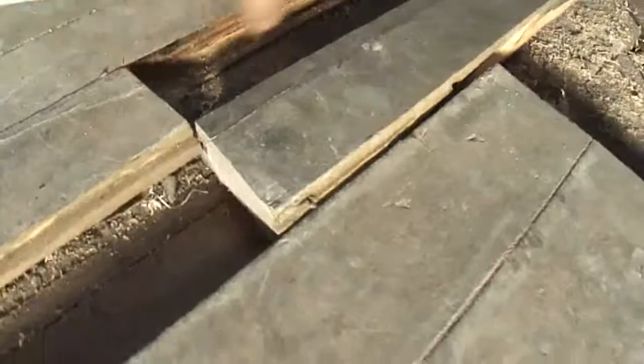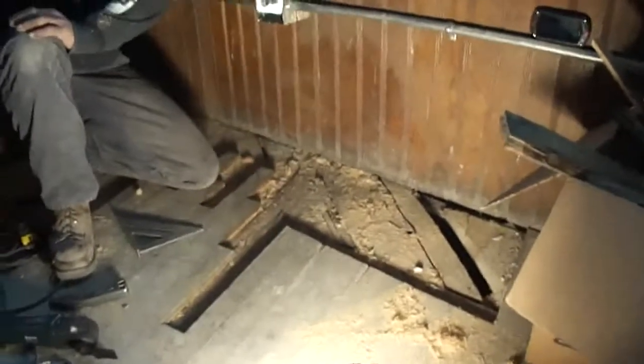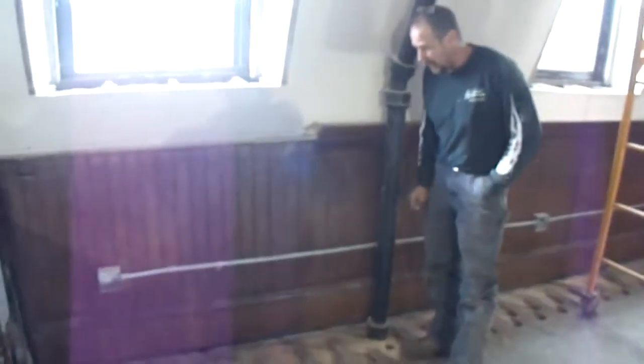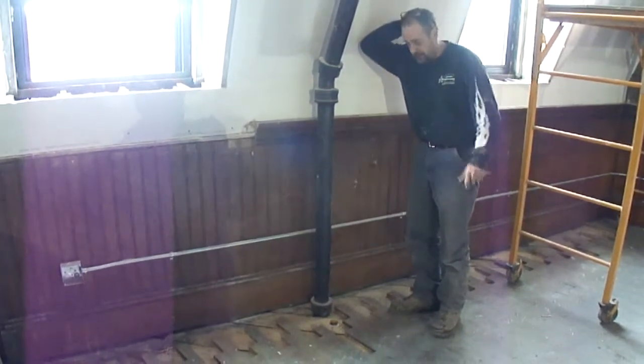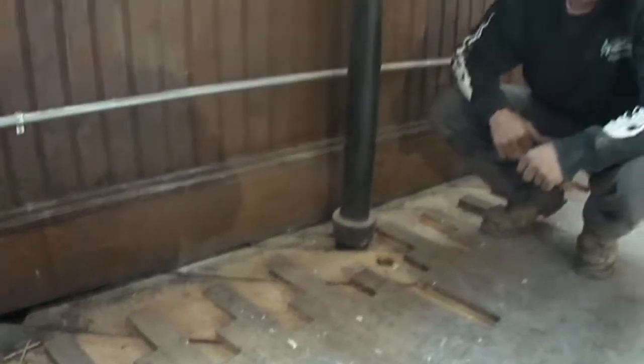I see this is where the tongue is right here, and the ones just next to it are nice and flat, so you'll be able to drop in some new pieces and they'll slide right in. Show me some of the finished area you've already taken care of, George. I've already stepped all of this back — we're waiting for the new tongue and groove boards to be milled up and delivered, and once they're delivered we'll start filling them in and bringing them right up to the baseboard. How long does this area take? About three days of eight-hour work — it's about 14 feet across.